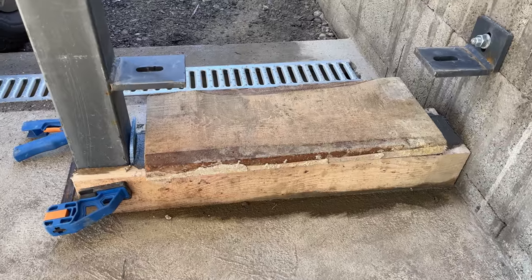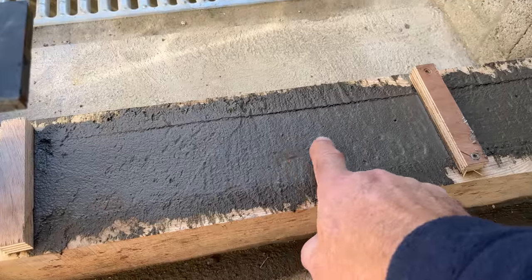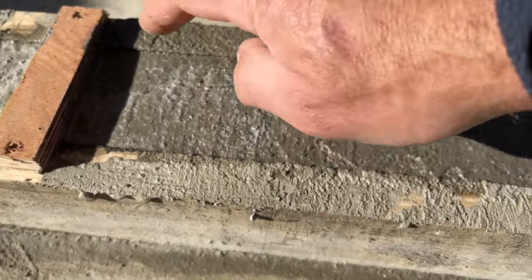So next morning, and I'm going to remove some of the forms. As you can see on this little one, it's in the shade, so it didn't get any sun yesterday afternoon or up to now, and it's sort of midday now, bit of a late one this morning. So I'm going to leave these forms on. I don't really need that wood anyway because they're quite small, and the same on the left hand side. I'm going to leave that one. The long side is in the sun. I've got to remove at least one of those boards because I need to carry on the forms now around that small room. So that's the job today. I want to get all of these little upstands finished today, basically so I can get on with the siding.